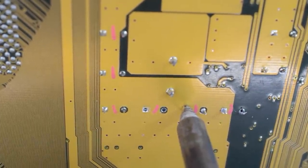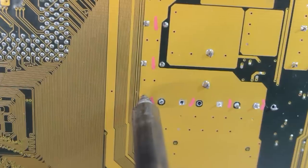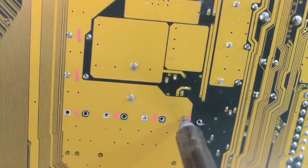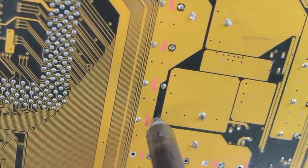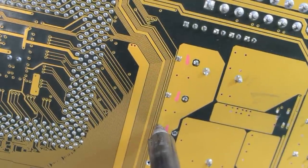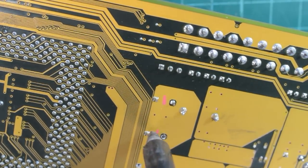I am of course skipping ahead here, but I'm heating each pad for about 10 seconds before sucking that solder out. By heat gun I don't mean the rework station — I mean the cheap heat gun from the hardware store for about 10 bucks. And then about 10 seconds with a desoldering gun at 450°C, which is quite a high temperature. I rarely go that high, but this was a stubborn board.